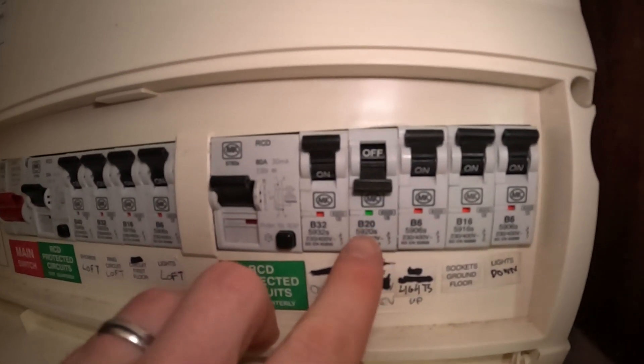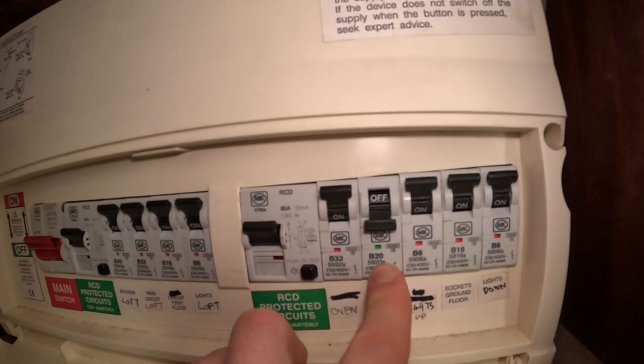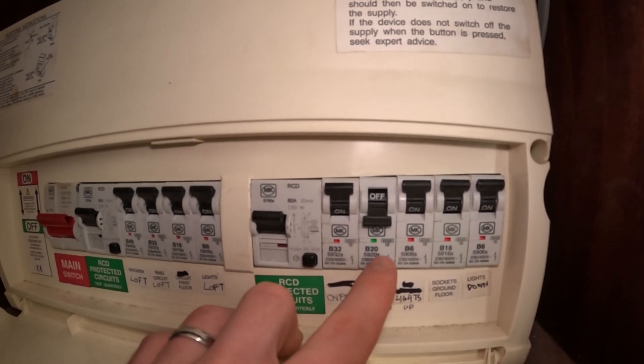The first thing you've got to do is identify the type of circuit you've got, and you can usually tell this based on the amps and the rating on the breaker. Mine here — this kitchen is on a 20 amp, a B20 — so the circuit's rated for 20 amps maximum before this would blow. So this is probably a radial circuit. If it were a ring circuit, it'd probably be a 32 amp. The difference between a ring and a radial is that a ring has two cables going back to the consumer unit, so you've got power coming from both sides into every socket. Whereas on a radial, they're just a daisy chain and the last one doesn't go back to the board. Mine I know is a radial because I've changed the socket covers in this kitchen before.